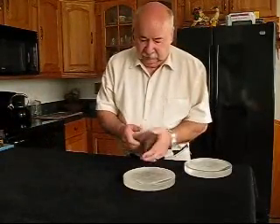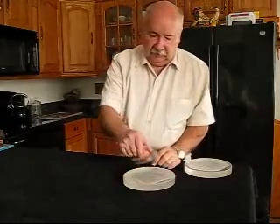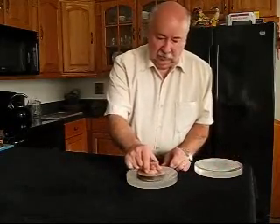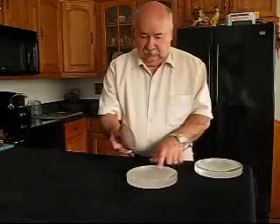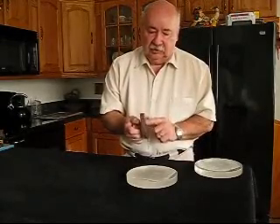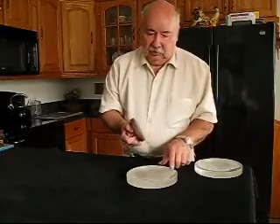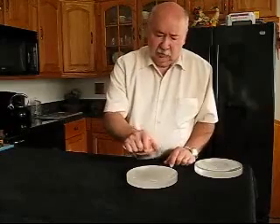One way you can do it is to take a piece of cast iron — this is a lap back. You can find a piece of steel or cast iron that's about half the diameter of your part. You can take your grit and grind your W stroke with a piece of cast iron. Your part will go concave and you will hardly touch the cast iron. Cast iron grinds away very, very slowly. So it's a lot more efficient — your grit isn't thrown off as much, you get better use out of your grit, and you're only grinding one curve instead of two.